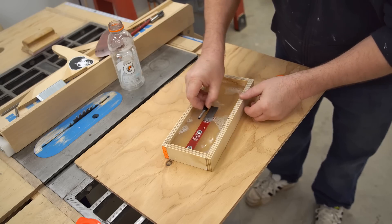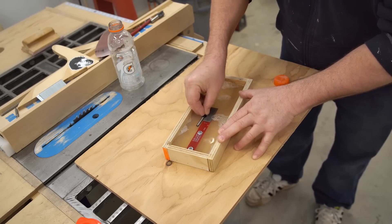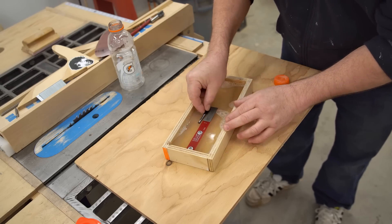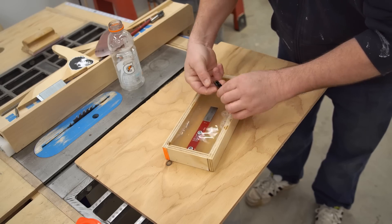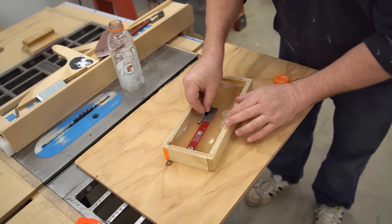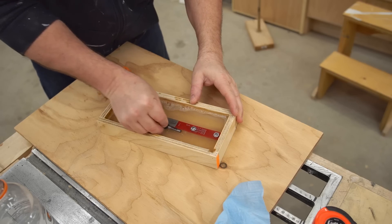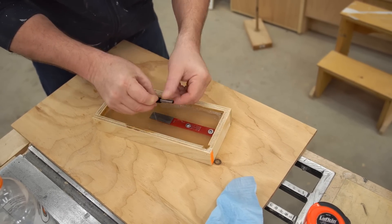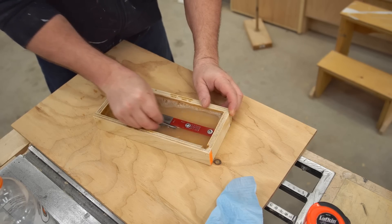Now I can start sharpening a bit. The idea is to sharpen the face of the bit by holding it down flat against the sharpening stick and rubbing it back and forth. This jig as it is has some limits — you really won't be able to sharpen larger diameter bits without making the thing physically bigger. One thing that would help is if the water you're using is warm; this water has been out in my cold shop and is not very comfortable to use.